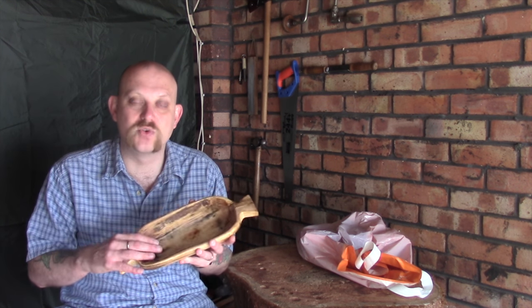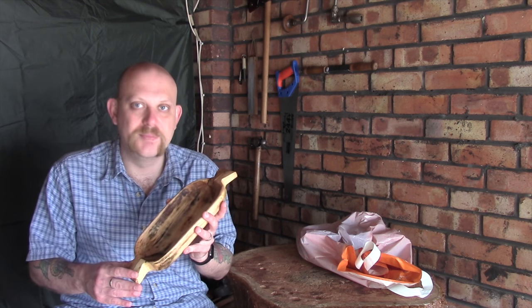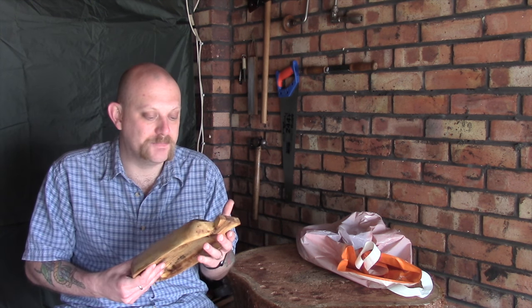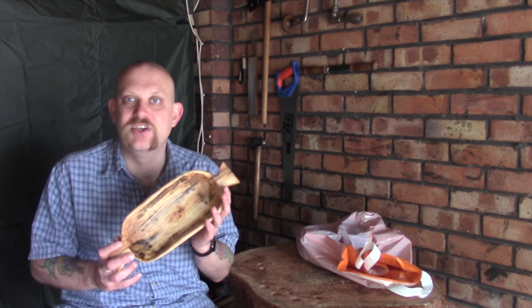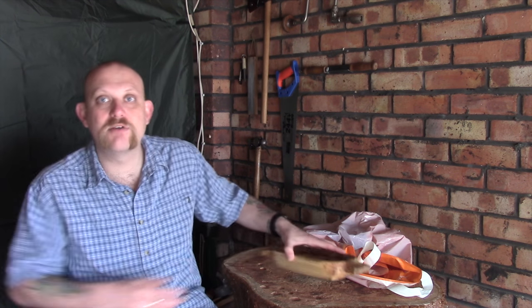The last thing I wanted to say is that where I say this is caused by mold and rot — which it is — it's certainly not dangerous to you and certainly not dangerous to the end product. This was quite heavily covered in fur when I left it for about two weeks. All you do is give it a quick wipe down with a cloth; if you're really concerned you can give it a bit of a sand as well. Then once you've put your finish on — whether that's oil, beeswax, lacquer, or whatever — it's now perfectly safe to use with food, with no risk of contamination or someone getting ill.